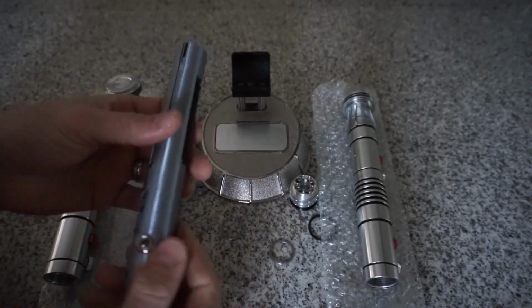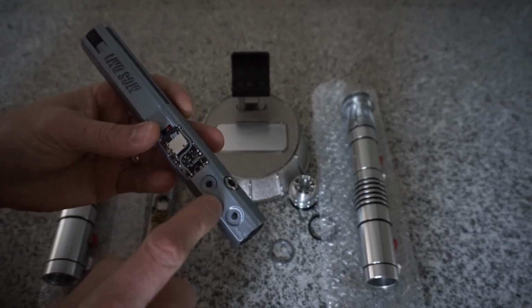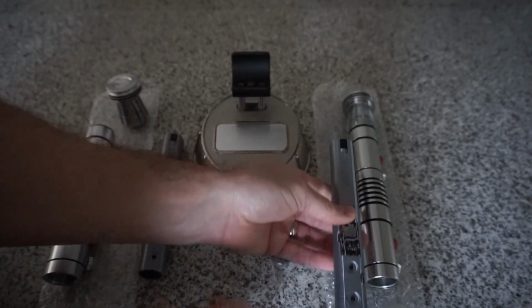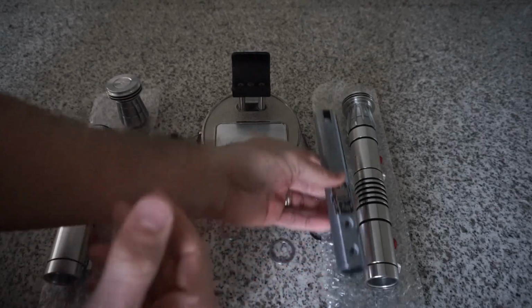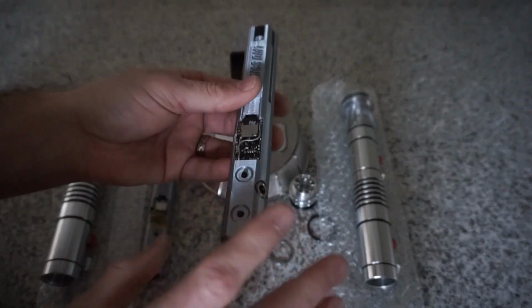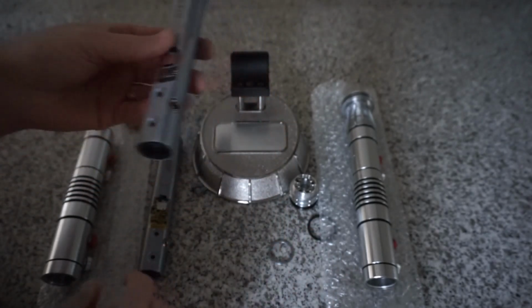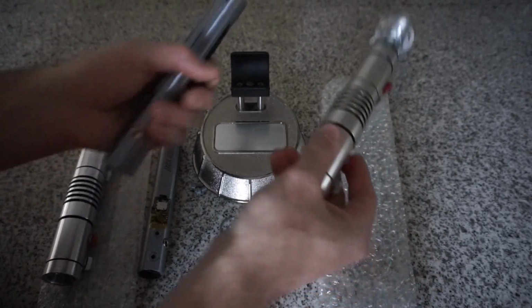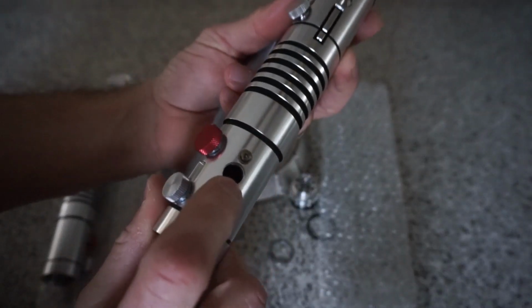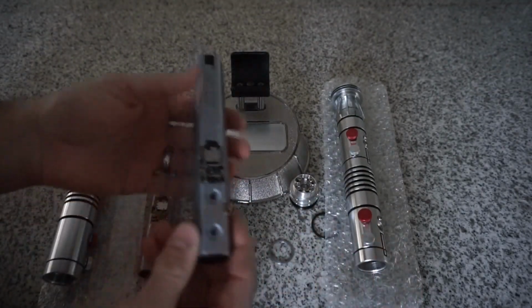Which was the initial design, right? This recharge port used to be here between the buttons. So you would just slide it out, recharge, put your kill key in, slide it back in. Again, the chassis was redesigned for this customer to move the recharge port, repurposing this screw hole for the recharge port access, kill key access. Okay.